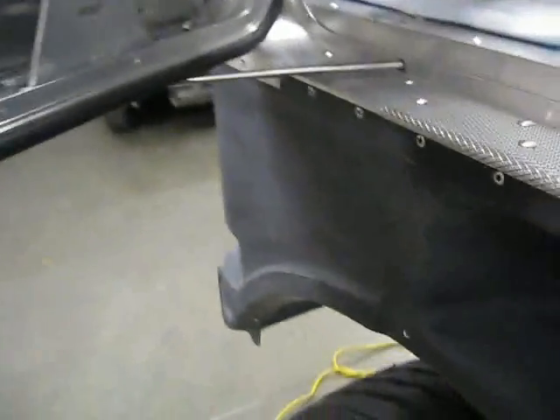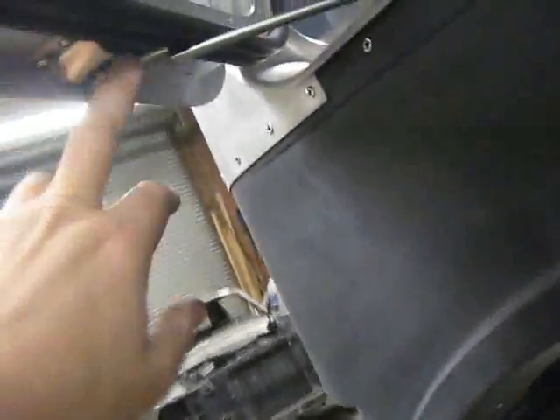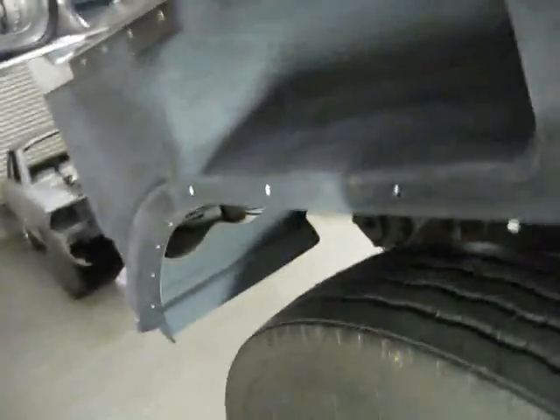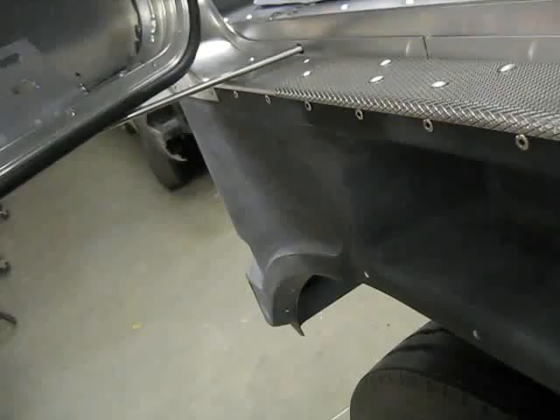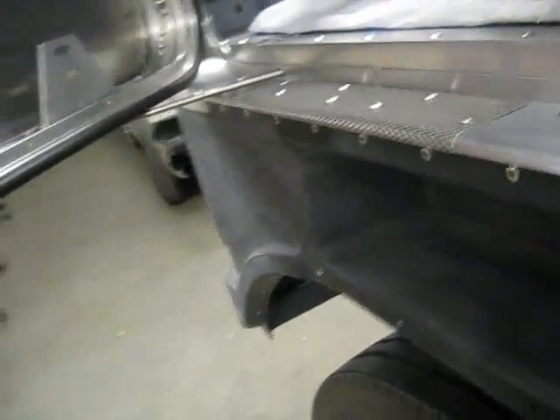Another little improvement I made here — the door closer, which always just rubs through the aluminum. Remade them in stainless, but also I mounted a block on the inside of the rail on the backside here that you don't really see — it's kind of hidden. So this rod actually glides on a bearing. It's got the rubber stopper on it and you can set the limit to the maximum opening, so now it just glides in a bearing right in the middle of that hole, which is nice.